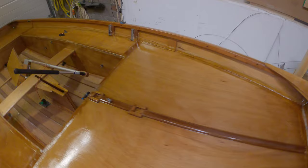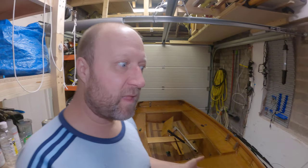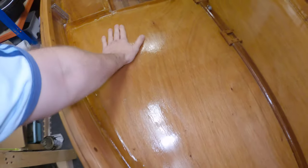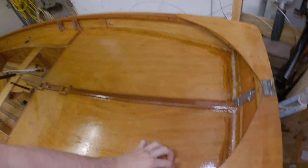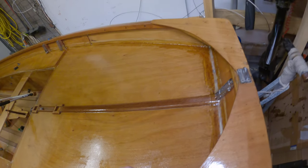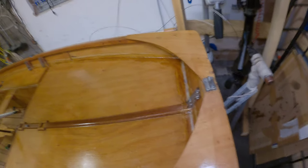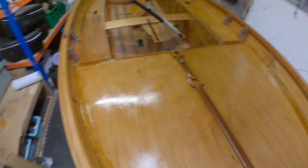Day three. I've been a little busy this morning so I haven't been able to get a coat on first thing — it's going to be a one-coat day. But the good news is the varnish is definitely set. It's not sticky at all. There's a little hair in it there, which is a shame. You can feel that grippiness of it — over time that will cure, but it's set and we're able to overcoat.